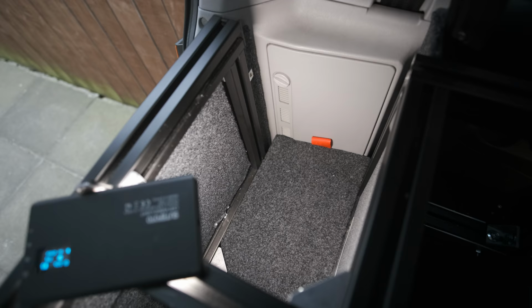One thing I wanted to point out was I've built storage space into the framework. So the idea being that I build the frame and then I can panel the frame, which will give me my storage units. And you've seen that being built over here with these two tiny units. I just wanted to point out one small detail, and that is that rather than boxing the backside of the unit, the inside at the back, rather than paneling and boxing that off, I'm actually using the interior trim as the back of the cupboard.